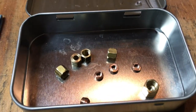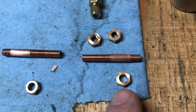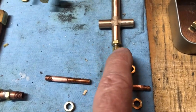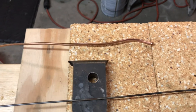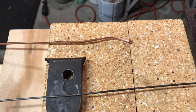Now that we've made the extra quarter inch hex nuts for the eighth inch piping, I pulled out and test fitted some of the copper cones as well. Found one that fit really good on the eighth inch copper tubing. And as you can see, I shined up the copper tubing with some sandpaper to get ready to silver solder. While I'm silver soldering, I'm also going to silver solder these nuts onto the copper steam intake pipes, just like we had done for the exhaust. I'm not cutting the copper tubing to fit just yet — I'm going to put that copper cone on the end and then it'll be ready to test fit in the chassis once I have everything installed.